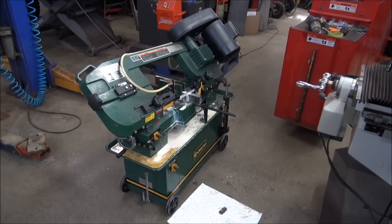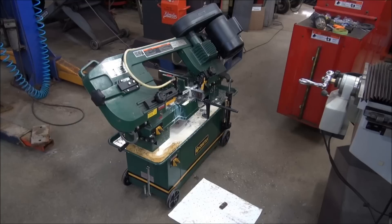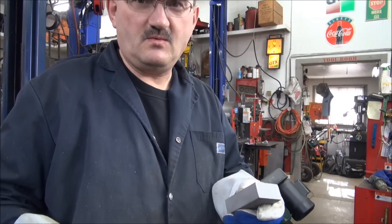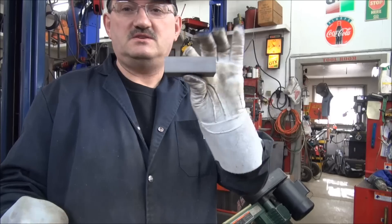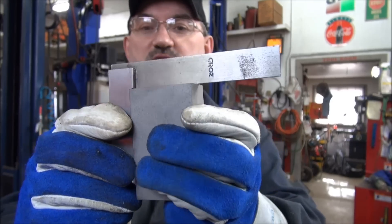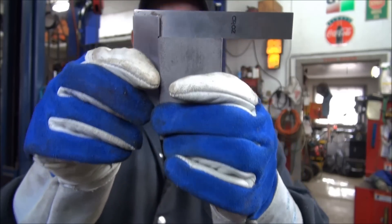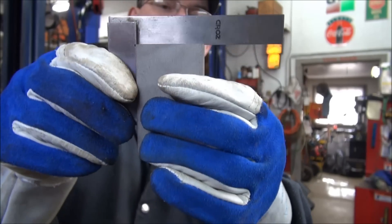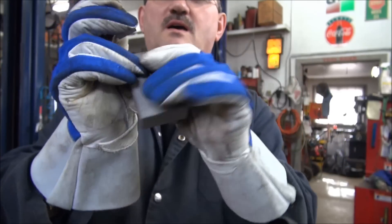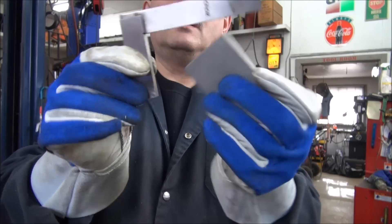We're cutting the section now for the three inch expansion — the extension on the cylinder. I'm going to use my horizontal-vertical bandsaw. It does a nice clean cut. You get guys asking about the horizontal bandsaw and why I use it — well, this is why. This is a machinist's square and I just finished cutting that three inch block, and it's dead on. When you're fabricating or building — no matter if it's wood, cement, or steel — if you start off straight and square, the whole project should follow through being straight and square. That's why I use the horizontal bandsaw rather than a cold cut saw or chop saw. They're just not accurate enough to do good work.